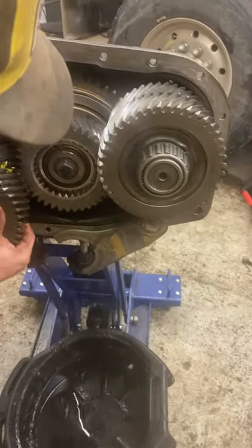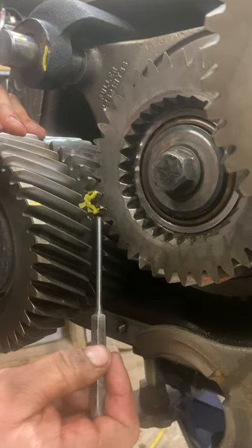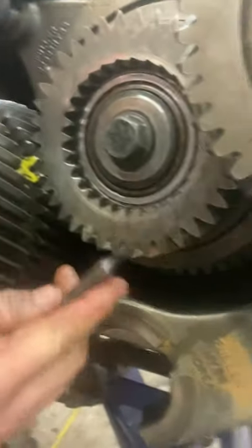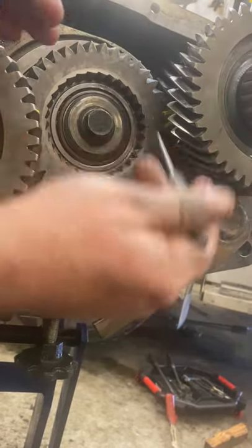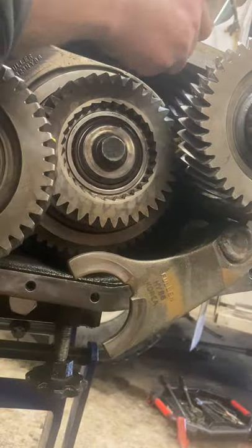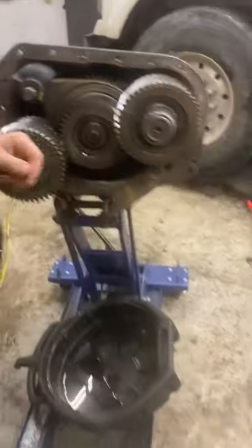When you go to this gear and turn it to check it, you mark that V so you're dead center. You've got a gear coming in, a gear going out, and this is the one that's biting the hardest. On this side you've got a gear out, coming in, and this is the one in the middle. So you've created those timing marks. We actually had this gear down one tooth, so these were kind of too low. You've got to line and time this one to the center, then time these ones to that timing mark so they're in the V of the middle.